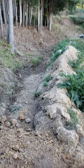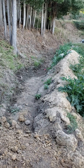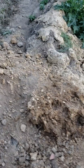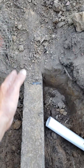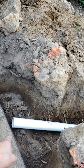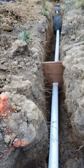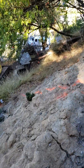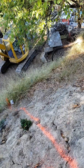We are in California. We haven't had rain for nine months or whatever it's been, but you can still see there's water there. So just past the water is where we started with a solid run of stormwater boxes. Now what we're doing before this year's rain comes in — here's one of my stormwater boxes buried — we are going to connect this four-inch pipe to the stormwater box. This four-inch pipe will then go all the way down to the street where it'll hit the city stormwater system.